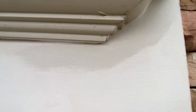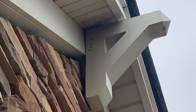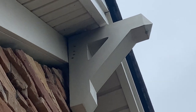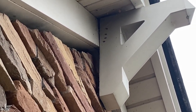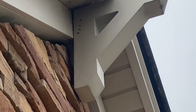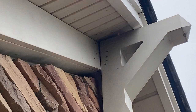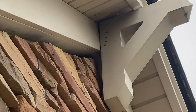He probably tried to do some sort of match and got pretty close — from across the street you'd never see it, but up close I see it. Just stupid little things. And look at all the holes up there — those are carpenter bees, already tearing the hell out of that thing. Tell me if that's flush fit up there — it's not. I bet those are drill holes for some big lag screws where they tried to get that thing straight, but it is not straight. There's a gap. See the gap at the top of that 90-degree leg? It's not even flush against the fascia.